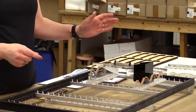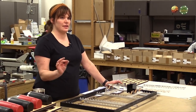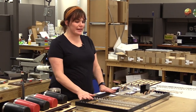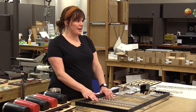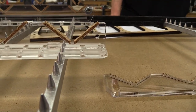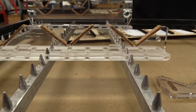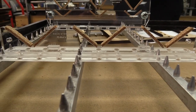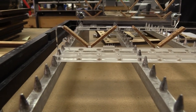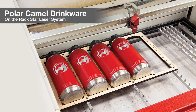Flat items like badge blanks or plastic can use their normal two-inch or one-and-a-half-inch lens that's basic to their laser. For flat plastic, MDF board, and similar materials, when the laser beam hits the cone it's going to deflect off rather than pass through like it does on a normal honeycomb table. So you won't get that flashback or that extra sticky residue on the back of the plastic because of the design of these cone shapes.